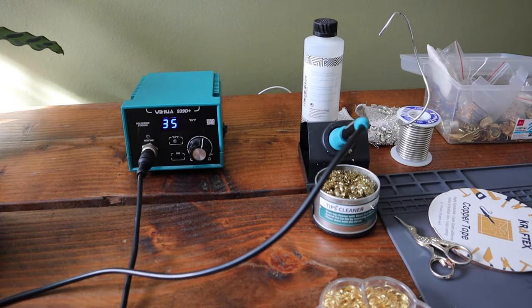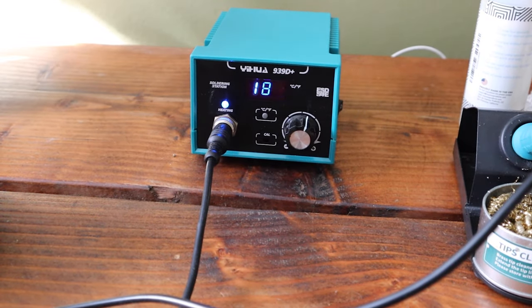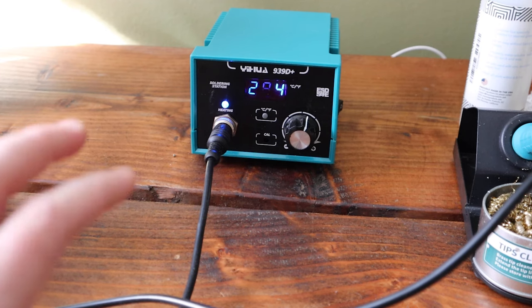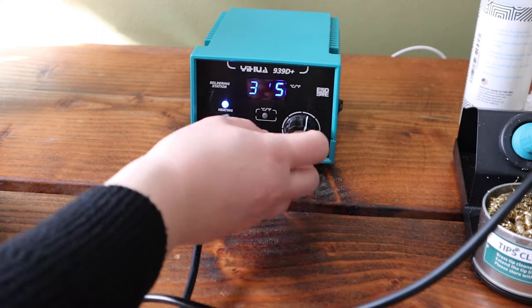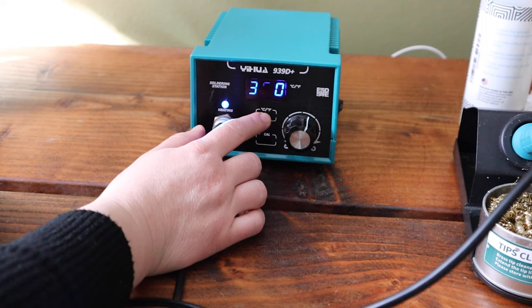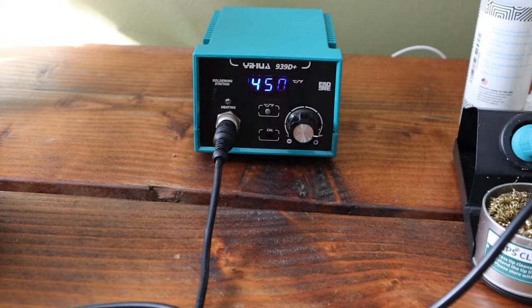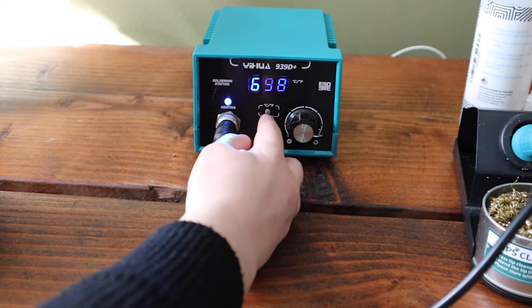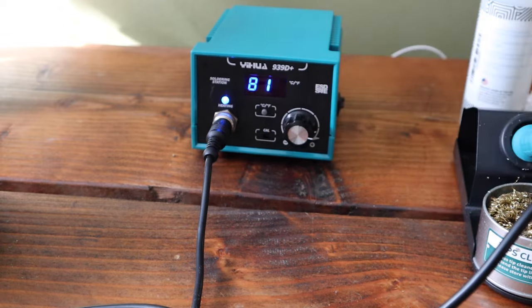I had a question in my comments, actually, which I will be answering a lot of them at some point in a little Q&A video. So basically, someone asked me, why am I soldering at 450? Because I realized that anything over that would be too melty, would be too hot for my iron. But then I also realized that I'm setting stuff in Celsius, but you guys are doing most of the things in Fahrenheit. I'm setting it 450 range thinking that's Fahrenheit, but it's actually Celsius. And it's really 837, so it's a lot, okay? Celsius, but maybe for this video, let's do it in Fahrenheit, so it's easier for you guys.